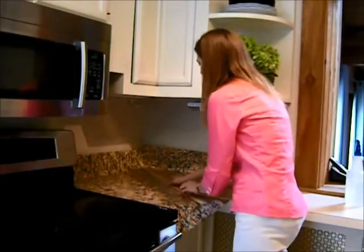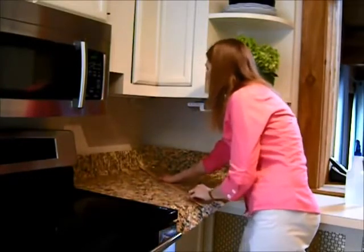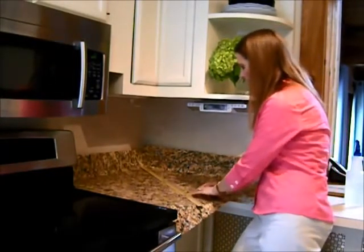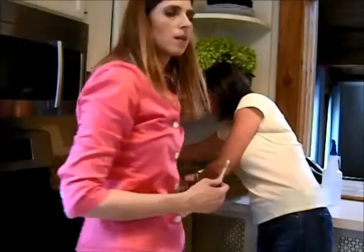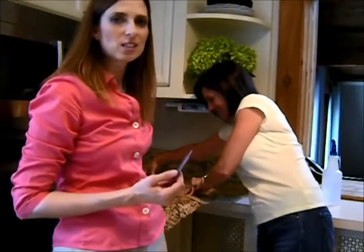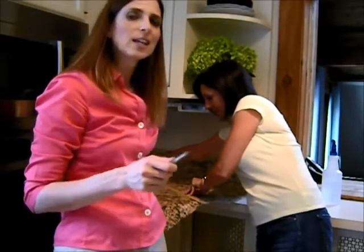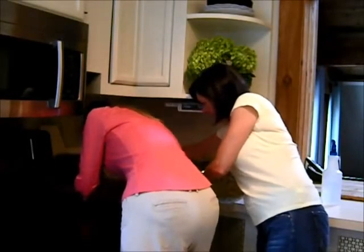Now I'm going to take my straight edge and locate the corner — you can't get all the way into the corner with a yardstick, but you can find where the corner is. Remember, you need to leave overhang for the edge, so I'm going to note where it is and poke a little hole right there as my marker. This is where it really helps to have a second person. She's going to hold the straight edge completely straight, and I'm going to drag along it with my cutting edge, going right through both layers of granite — plus a layer of backing — so I need to press pretty hard.